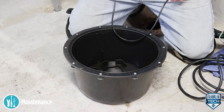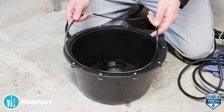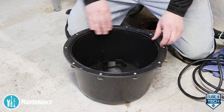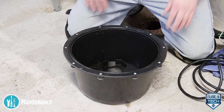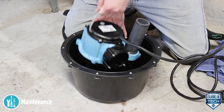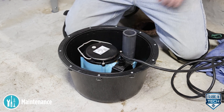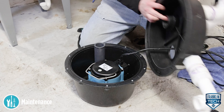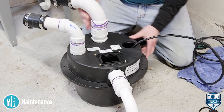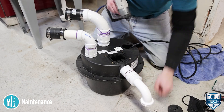Reinstall the O-ring to the basin. Inspect the O-ring — if it is over-deformed, the cross-section is no longer round, it is cracked, or it is no longer soft and pliable, replace the item. Reinstall the pump, ensuring it sits properly on the pump alignment plate. Reinstall the base and cover, making sure the pump discharge pipe meets properly into the discharge hole in the cover. Tighten the cover screws to a torque of 18 to 20 inch-pounds.